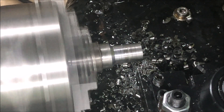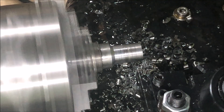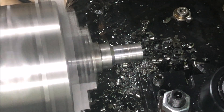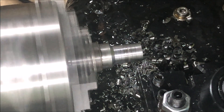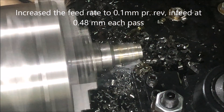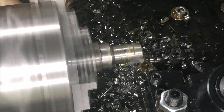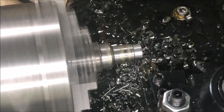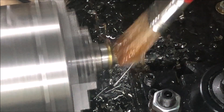Of course, this is more like how you would want to do it — namely that if you should go in that much, you would part this as the controller says, into six passes. You can increase the feed rate. So let's try that also. No problem. This is probably much more like what you should do.